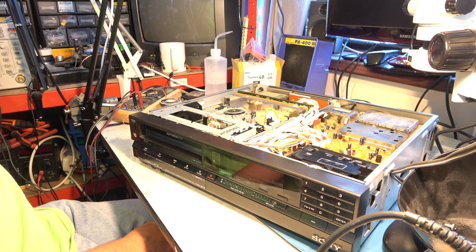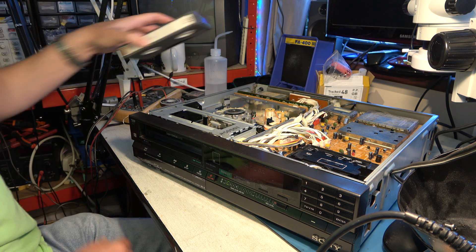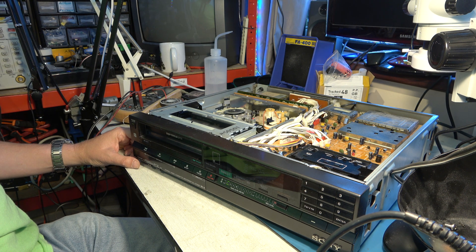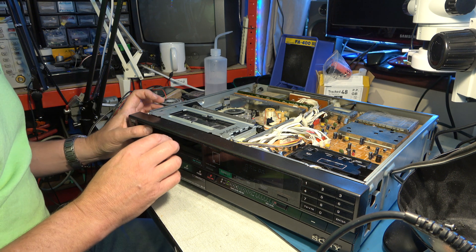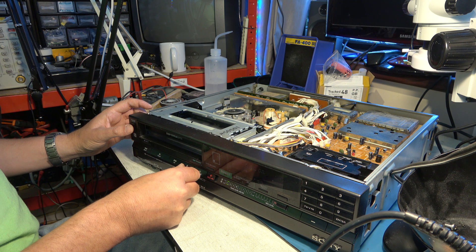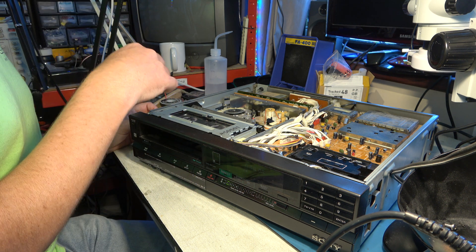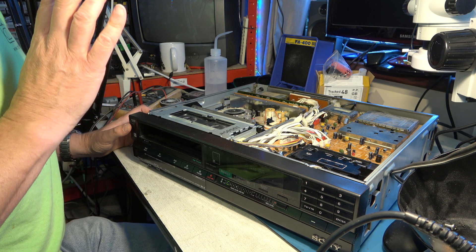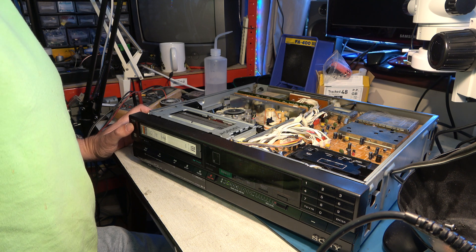Switch on - that seems entirely sensible. Let's see if we can load the tape. There's no recording on this tape but just mechanically it should have gone clonk at the end. It's in a right mess - that was wrong. Stop - don't do that to my tape. It appears to have gone into a pickle; it may not be detecting the completion of lacing properly. It seemed to work a lot better overall though - I need to just disentangle this.